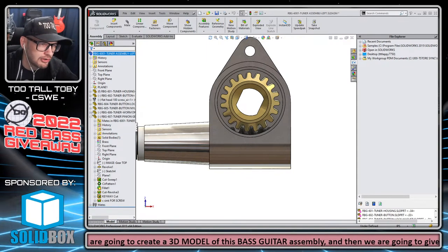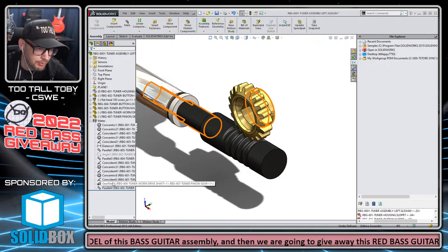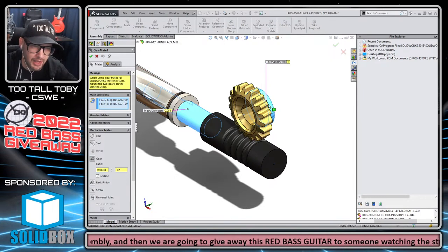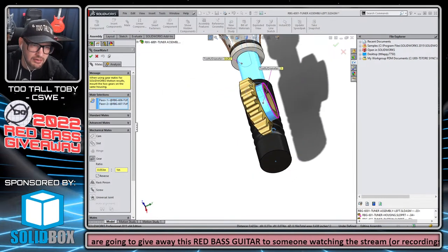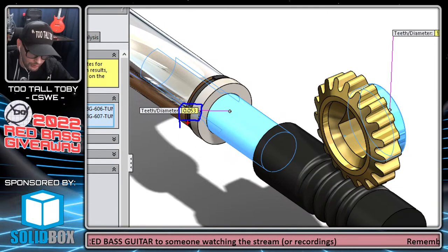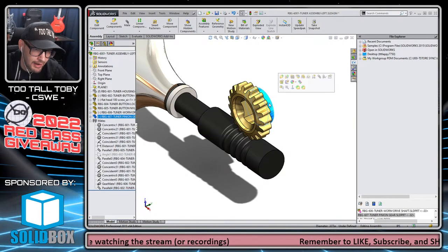One of the first tricks that is extremely helpful is that the way the gear mate works is you define a rotational relationship between two components. So you say, whenever this cylinder here rotates a certain number of rotations, we're going to have this one rotate as well at a certain number of rotations. So whenever this rotates one full rotation, this cylinder back here goes one full rotation, well, this will go essentially 1/20th of a rotation. It'll go 0.053 rotations. So that means that when we start dragging this component around, it has to go around 20 times in order for this gear here to go around one time, or vice versa.